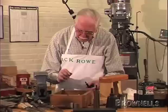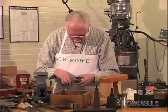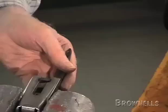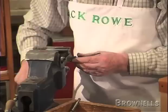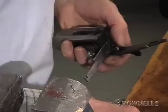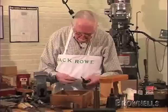Now the next move is to take the top lever spring out. You can do that by using that little tool I've got — by pushing the lever over, putting that little tool on there to hold it, lifting the back end of the spring up, and then just sliding it out. There we go, top lever spring out.